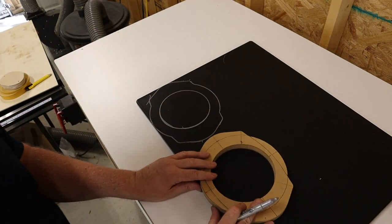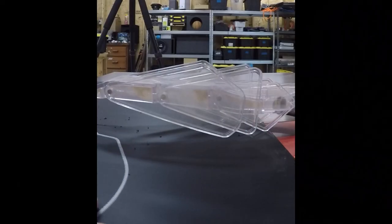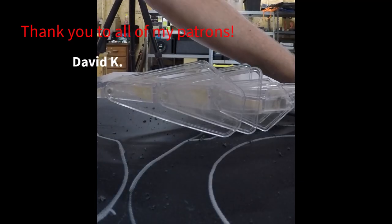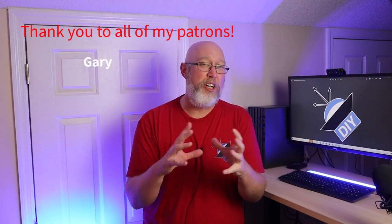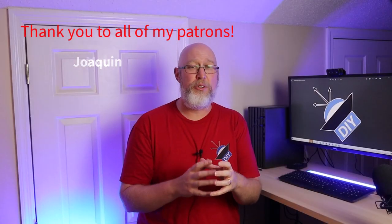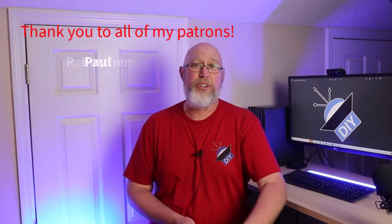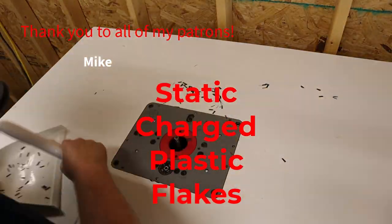I thought I'd be clever and try to cut this down to size on the table saw before rough cutting it with the jigsaw, but cutting plastic can be tricky. The plastic actually started to bind, so I aborted the cut — pretty sure I would have had a kickback if I didn't have the riving knife installed. Off camera I just grabbed the jigsaw and rough cut around the lines. After that I used some double-sided tape to attach the ring to my template and then attach everything to a router shield. I definitely recommend getting a router shield if you're going to use this kind of material — the router bit is just more likely to grab when you're using HDPE and that could go south in a hurry.